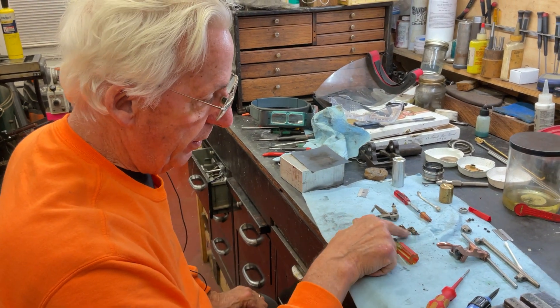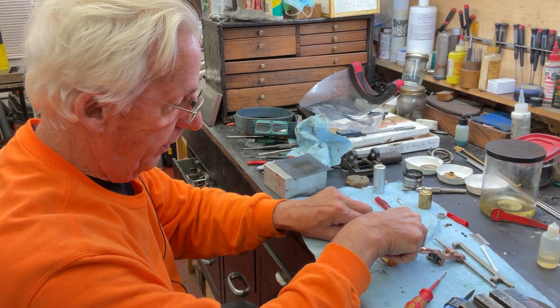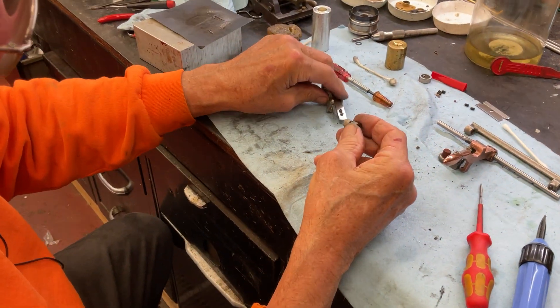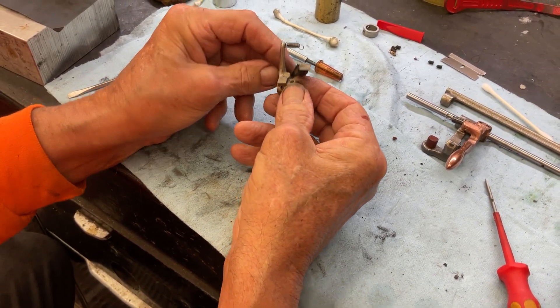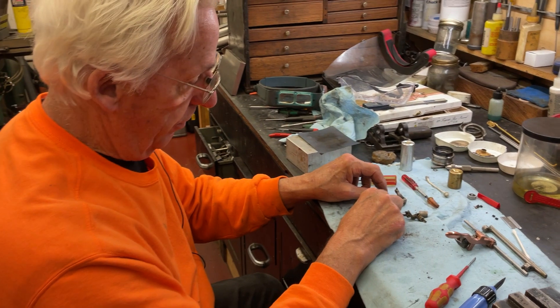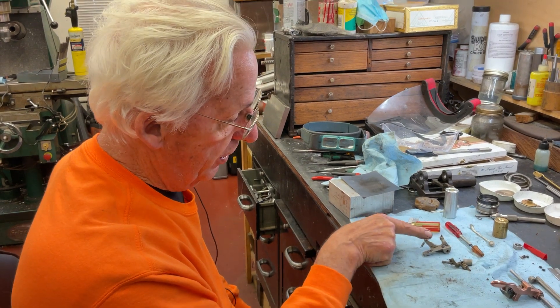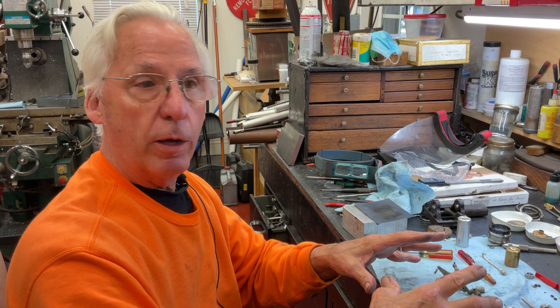When you hit the handle to shut off and come up, this will come up also. This piece right here is on the shaft underneath — you see that little wear spot — and that wear piece hits right here, so that comes up and lifts it. When the shaft turns, this comes down and rotates like that. This is how to put in the half nut and spring into this piece. This screw sticking out is an adjustment on the carriage — I'll show you that on final assembly. This is just the prep, and this is the most complicated part of an Amberola A1, A3, or similar. That's my tip for the day.